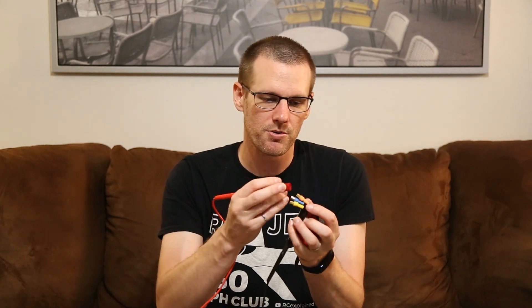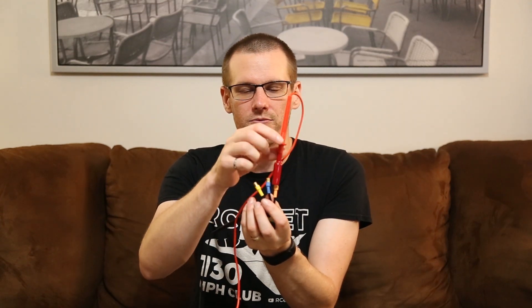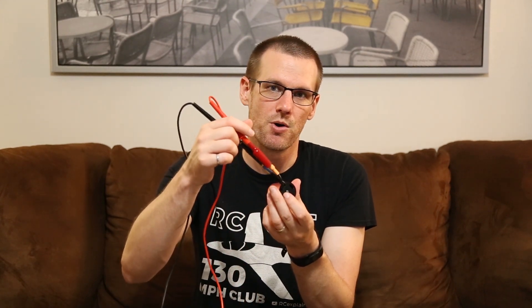We have three wires out of this motor. Take the leads of your brushless motor and connect them: red to red on the multimeter, and the negative on the multimeter to the blue wire — that covers one of the three phases. Next, mount the drill onto the shaft of the motor, spin it up, and measure the frequency on your multimeter. I'll include a short clip here so you can see exactly how this is done in more detail.